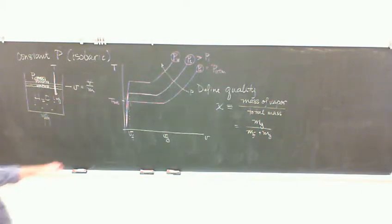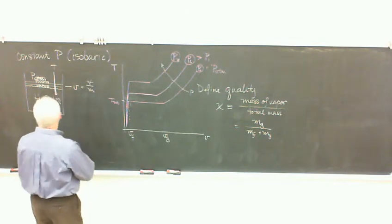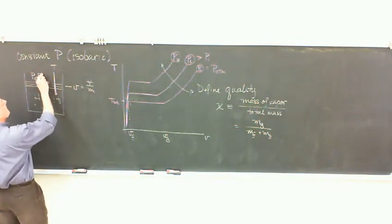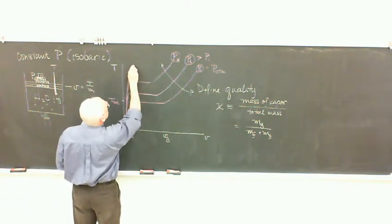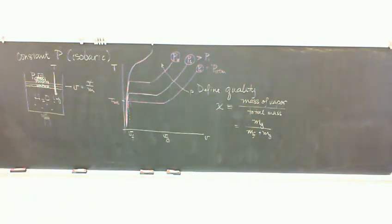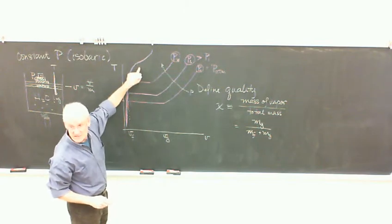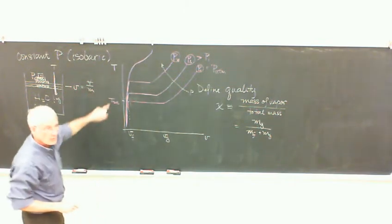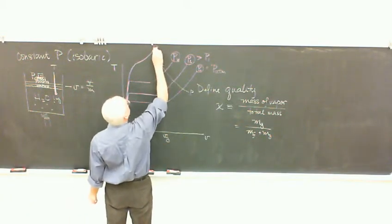And we do that again, we get a smaller flat spot, and so on, until finally we've got just the right amount of mass on there, and we run the system, and we get no flat spot. Any pressure below that, we had even the tiniest little flat spot. Now we have no flat spot. We have an inflection, but no flat spot. That's the last pressure from which we have a flat spot. That's known as the critical pressure,